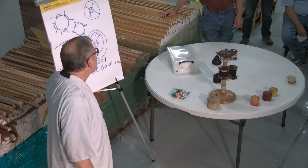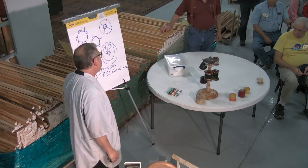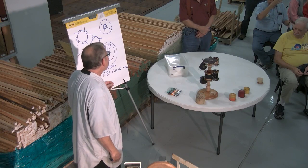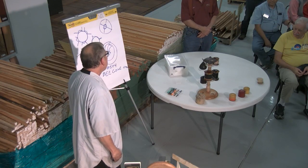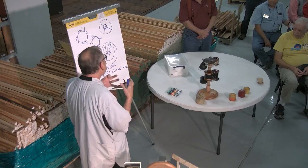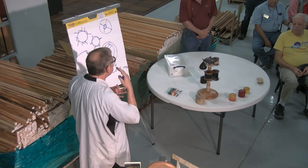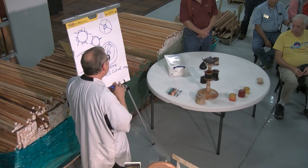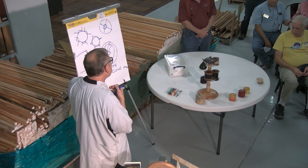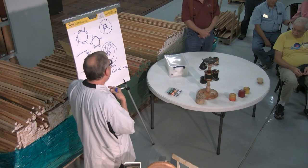Is your spray lacquer pre-catalyzed? I started painting cars in the late 60s, and I owned my own paint shop. I painted Corvettes all the way through the 70s, and all we painted was lacquer. I don't know what pre-catalyzed lacquer is. Lacquer by its nature, when you spray another coat on, dissolves into the bottom coat. That's different than urethanes or polyurethanes. If a polyurethane is cured and you put another polyurethane on top of it, you have to scuff it. You get two kinds of adhesion between finishes. You get either mechanical adhesion, because it's attached to the scratches that you put in it when you sand something, or you get a chemical bond adhesion where it melts into it.